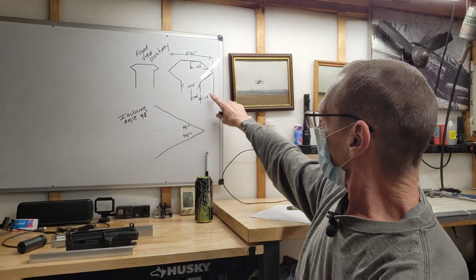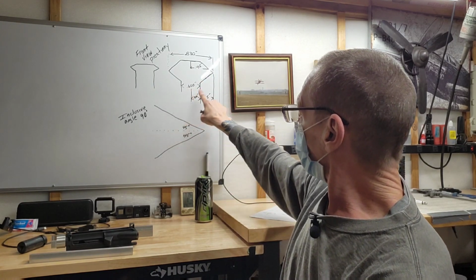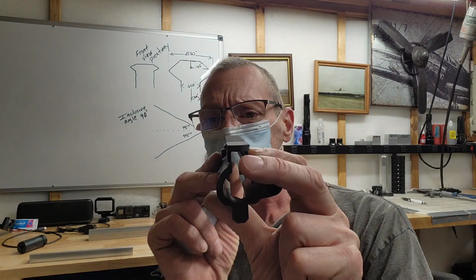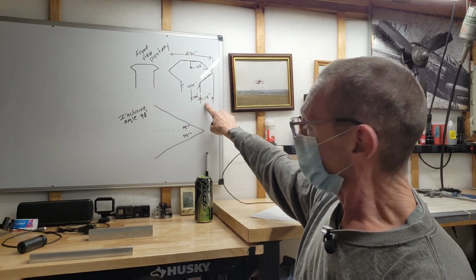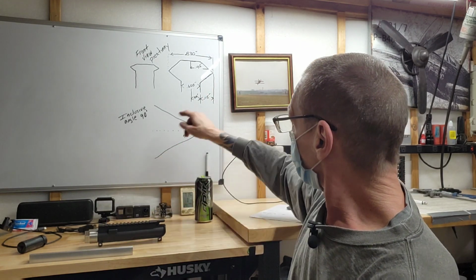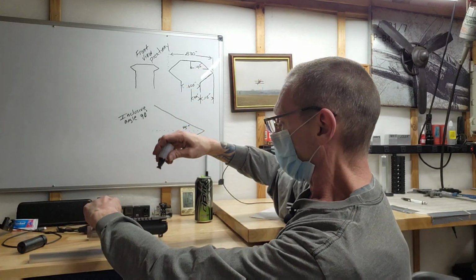So anyways, here's how you break this down. We take our overall width and divide that in half. We go down here and we get our channel width. This is our base, whatever you want to call it, which is this width right here, between my fingers. Okay, and that's 600. So it's not that hard to find out how much we're going to cut off each side. There it is. We're going to take 115 off each side. But basically, it's 415.